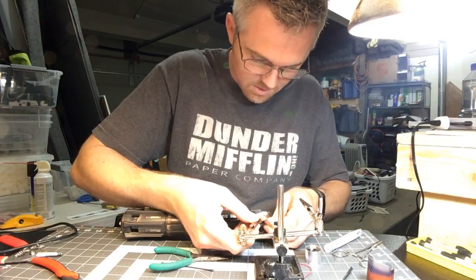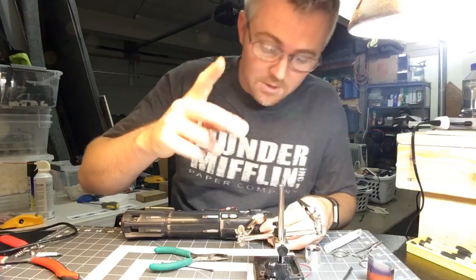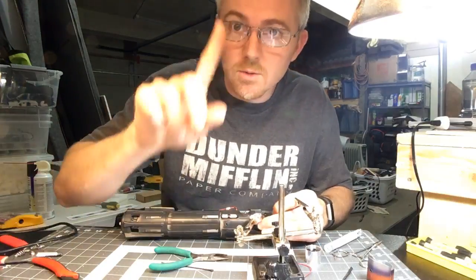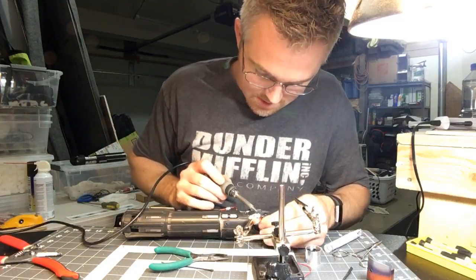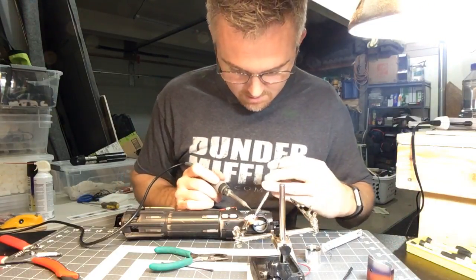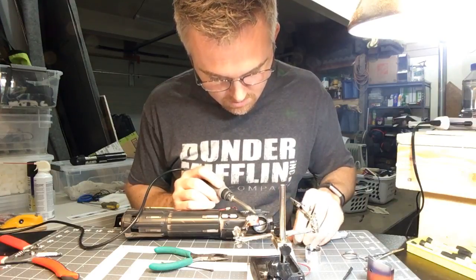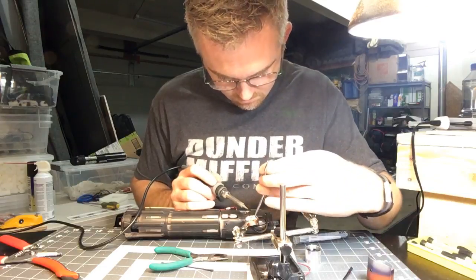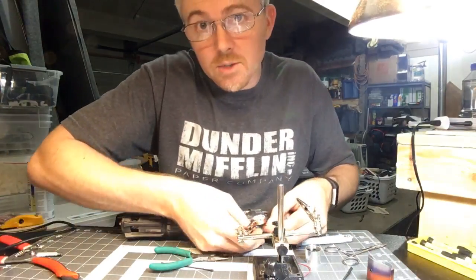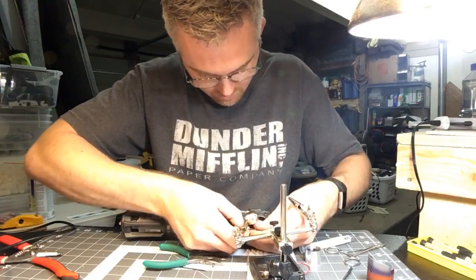I had to go and be live streaming to do all of this and then screw it up right on the live stream. So, in case you're wondering, what I did was I forgot my color coding and flipped the negative and positive with these LEDs. Don't do that. Keep your color coding straight. Since I've done this, I've actually switched up my color coding a little bit, and I use a little different setup so that it's a little easier to remember which one goes to positive and which one goes to negative, because I don't like redoing stuff very many times. I actually don't like redoing stuff at all. Not fun. It's not as fun as you think it is, fixing up all your work after you get all the way done.